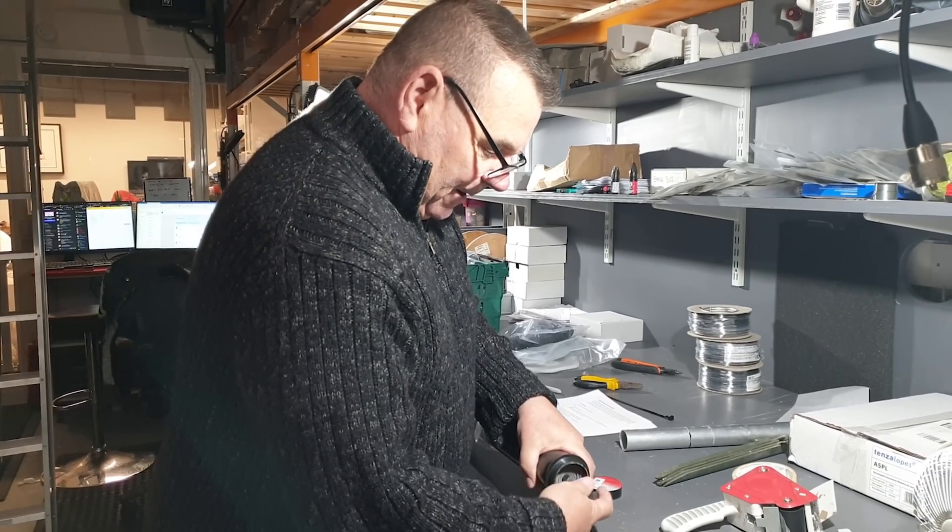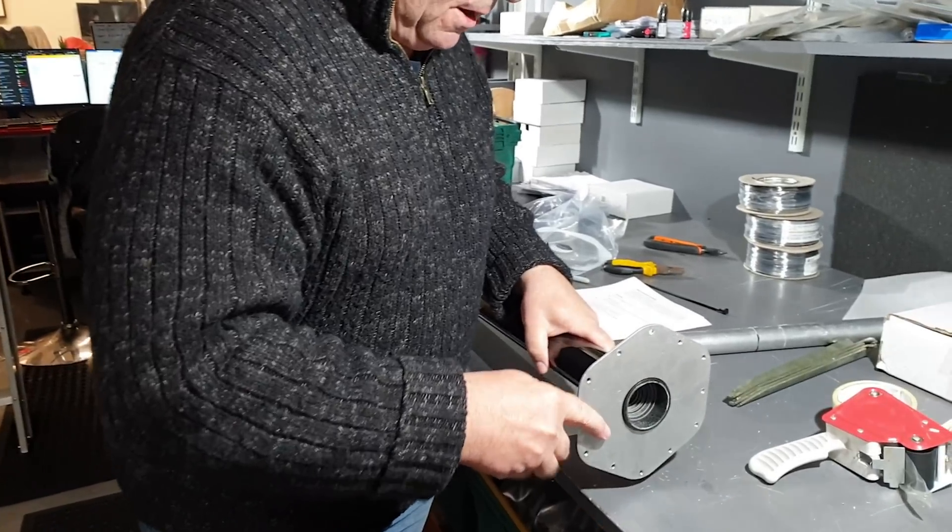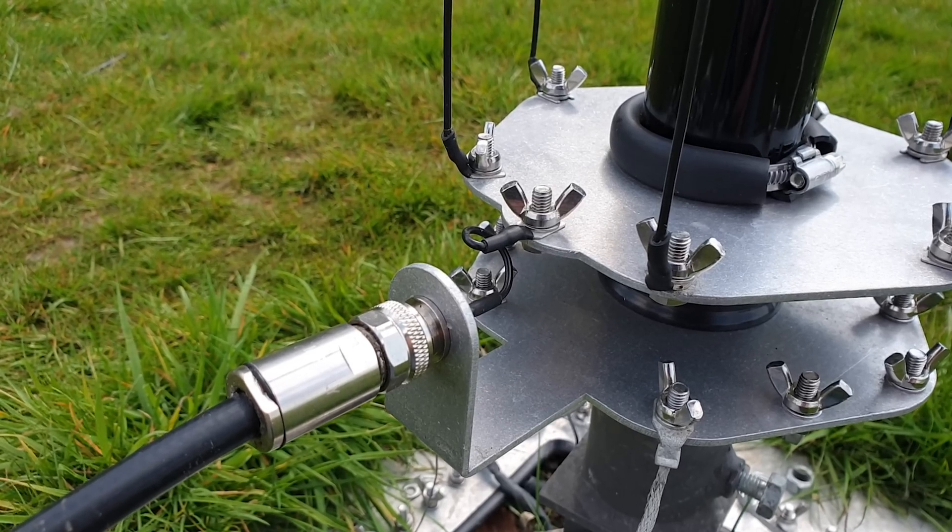We're going to cover the actual pole itself. The pole has a screw cap — you take that cap off and put on the ground plate, the one with the tab. It's all in the user guide. Everything on this kit I've intentionally made quite a tight fit. On the driven plate — that's the one with all the elements going up — if you look on the inside diameter, there's a tiny pip where the waterjet machine just missed; you might want to file that off with a bit of sandpaper. Doesn't matter, it's still a tight fit — I've done that intentionally.